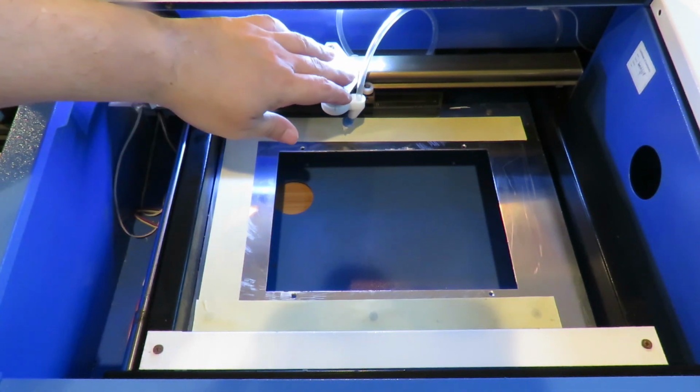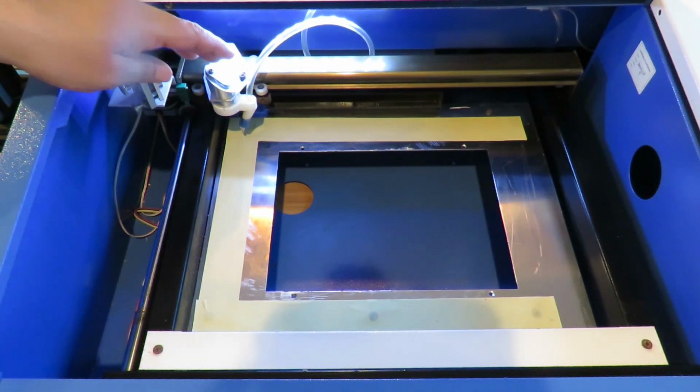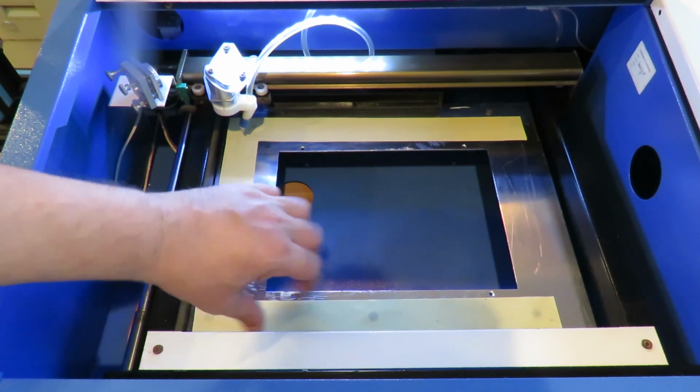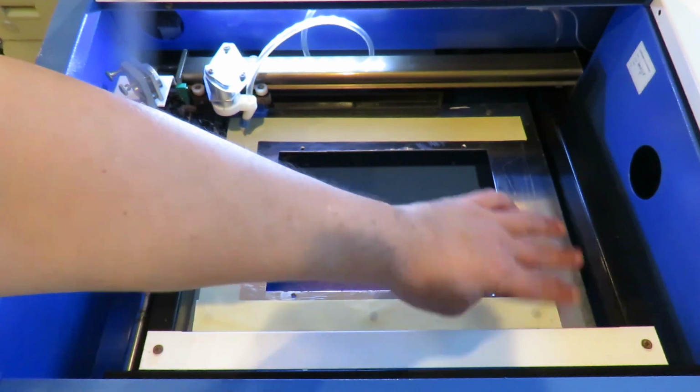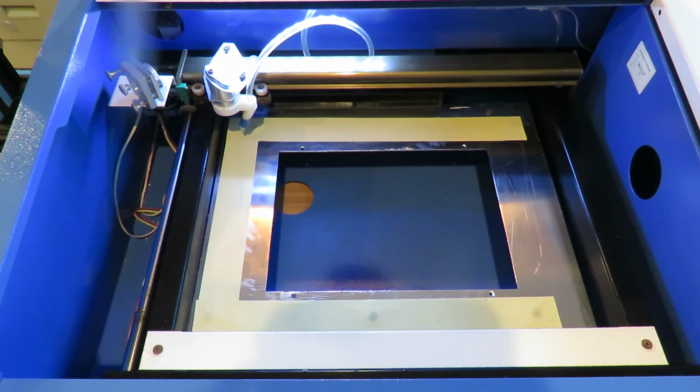You will make your registration markings once, use the machine for a while, and sometime in the future, you'll clean and reapply the masking and markings. I am on my 4th set of markings on mine, and you can see how easily things clean up each time. I go ahead and apply the masking tape across the top, just above the cutout on the bed, about 35 centimeters wide, and vertically across to the left, about 22 centimeters high. I also apply a third band of tape across the bottom, as wide as the top band.